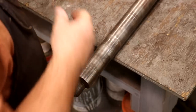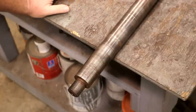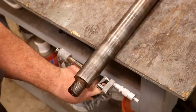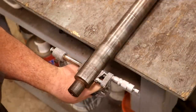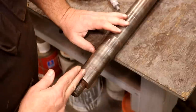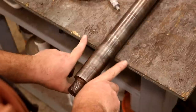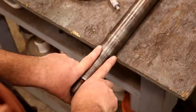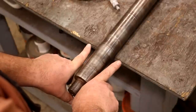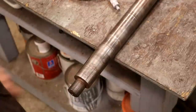So 21.6 thousandths per inch is my taper — that's pretty much exactly what we measured, and that multiplies out to about a quarter of an inch per foot. Just a cool little tool. I've used this several times and it's a nice thing to have around when dealing with these tapers. Now, when we cut it on the lathe, I need to set it for half of that angle, because when you look at the taper it flares out in both directions, but on the taper attachment we're only interested in half. So on this one, I'd set my angle at one-eighth inch per foot.